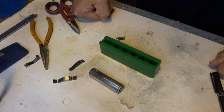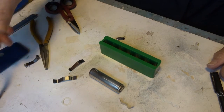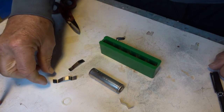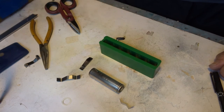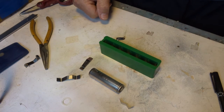If you want really good welds, use 0.10 — that's the only conclusion I can pull. Despite all my efforts to improve my mini spot welder, if you want a spot welder that welds 0.15 better, buy a heavier welder — a KWeld or maybe a Keymon 5000, something like that.